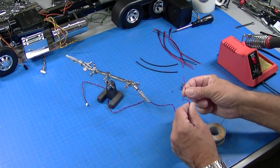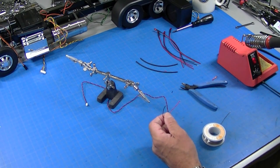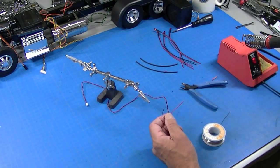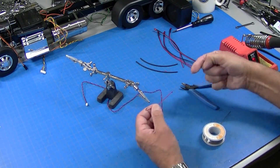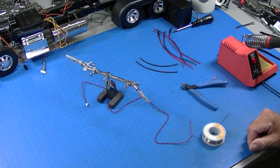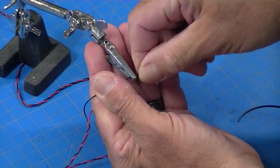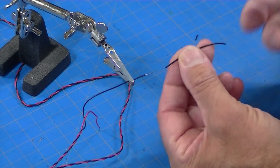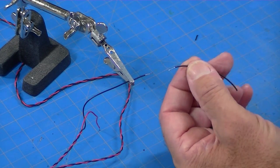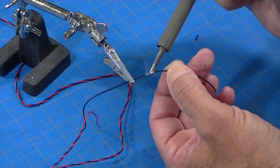Now if I was going to extend this, I would use my 30 gauge wire that I showed and just do the same thing. And I'm going to show you how to solder two wires together. So here's my wire that's stripped and tinned, and then I've got another piece here. This would be, for example, what I want to extend, and it's also stripped and tinned. So now I just touch the two wires together,